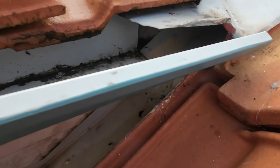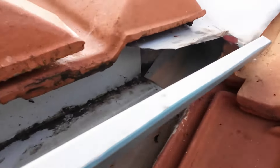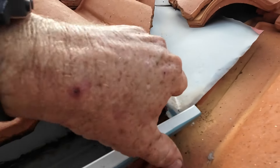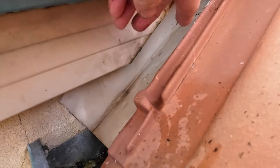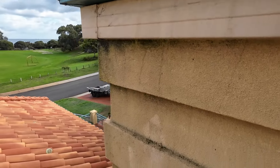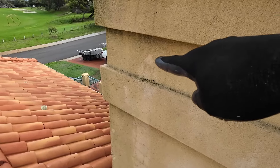Our job today is fixing a leak. What this roof plumber has done is put on a new gutter, but he's left the fly-over short. The gutter should always go past your fascia, but he's cut it short. When the water comes in it hits the fascia, runs down and gets caught underneath, causing it to run all the way along the bottom of the fascia. You can see how wet that corner is — it's flooding down the corner, wrecking all that plaster and getting inside the house.